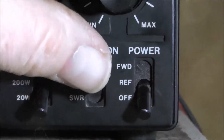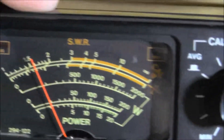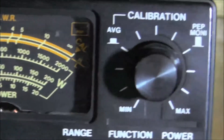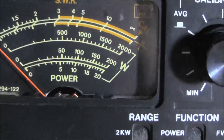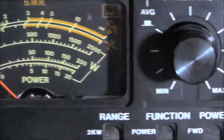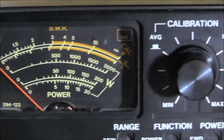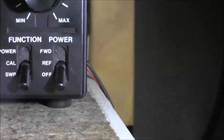It's a bit hard to see, but up in the right-hand corner right up there — the light's not the best — so the calibration's good now. And we change that to SWR. The SWR is about 1.6, so that's not too bad. We're pretty high up on the 40 metre band and my inverted V's not the best there, but does the job.